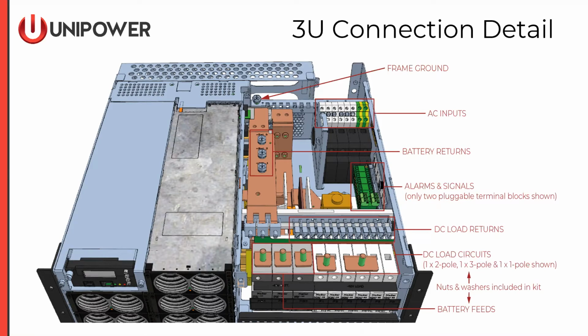These are 18-millimeter load breakers. Some breakers utilize 2 and 3 18-millimeter positions, and these breakers will be equipped with adapters. We see a 2-position adapter and 3-position adapter. And to the right of that, we see just the standard 18-millimeter breakers with a cable landing directly into the breaker at the compression terminal provided.